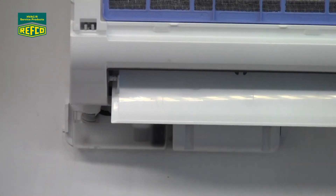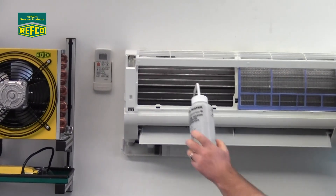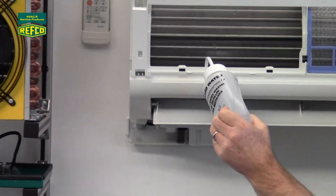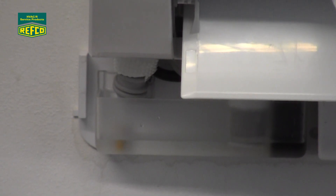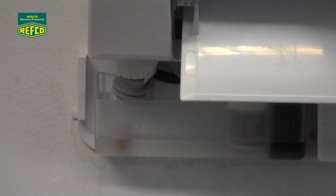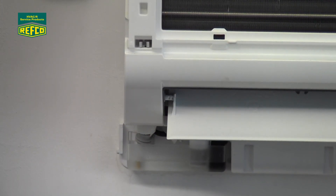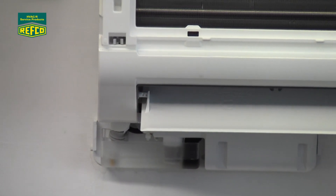Make sure your water drain is coming down. We're going to talk about the wiring in just a second. This one's already wired up, so we want to go ahead and test it to make sure it's working. What I want to do is take a little bit of water and put it into the condensate drain pan and make sure the plumbing is all working properly as a test. Now, when this fan coil first starts up, it's going to be a little bit loud — that's only because it's starting dry. But once it primes itself, it's going to run quite a bit quieter. It just started. We're going to let that run until it stops, then put a little bit more water inside that drain pan just to make sure it's working and stopping when it's done.